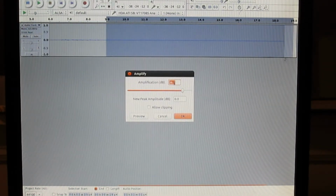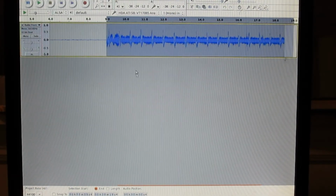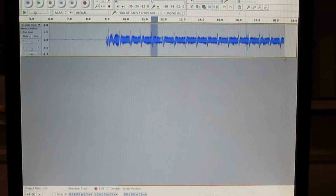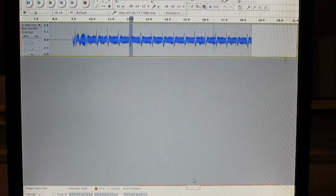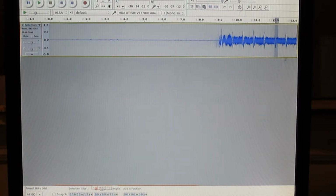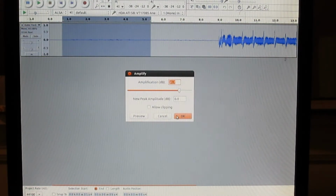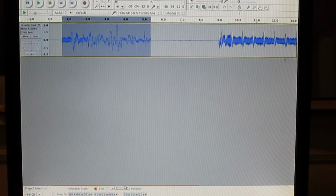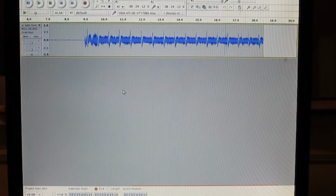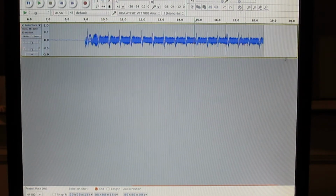So that's 36.9 dB, so about 40 dB, which is a voltage gain of 100. And there it is. This gave me exactly no trouble at all. No messing about with the electrodes, trying to get things just right. It just sort of worked. Except for that. That didn't just work. This over here, that just worked. Alright, now I have all this noise on there, and that's the next thing to figure out.